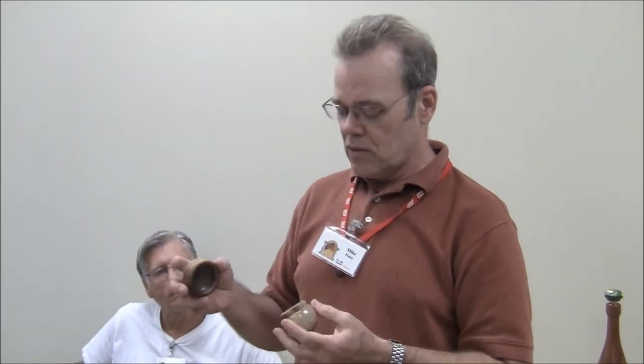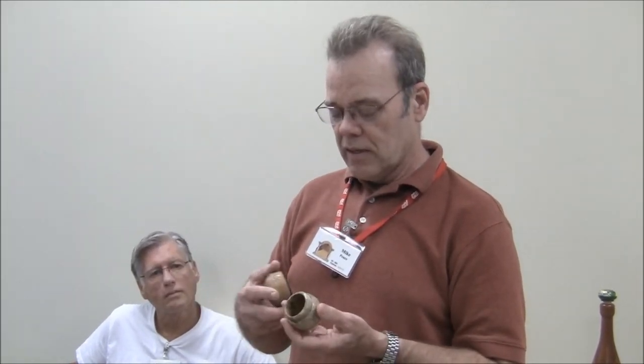And this is a box I made. It's got too many threads on it. You shouldn't have to turn it more than one and a half turns for it to be useful. It's a piece of ambrosia maple I got from Wes Jones and a piece of walnut. This one was threaded on the homemade threading jig that I'll probably demonstrate in February. Bob's got one that fits a 12-inch lathe and I got one that fits a 10-inch lathe.